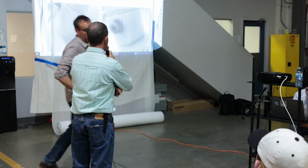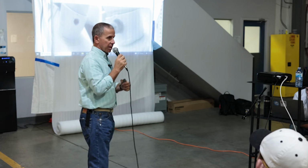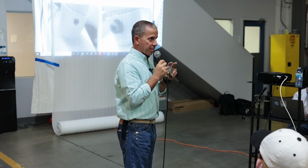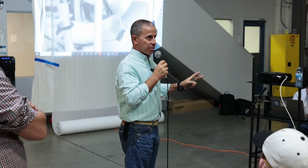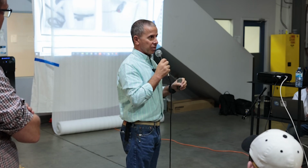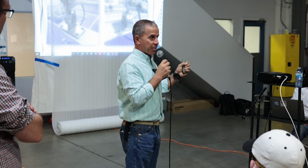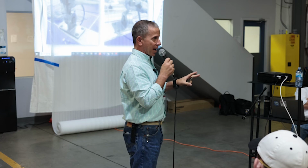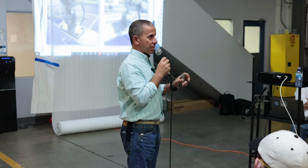Right. Okay, and I tell my clients this all the time. If you have a painted aluminum boat or any painted aluminum structures on a boat, and that's almost every boat today, catching this stuff early is critical. So the moment you see paint failure beginning to occur, typically around a fastener or a flange, attack it at that moment: clean it, prime it, touch it up before it begins to spread.